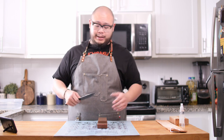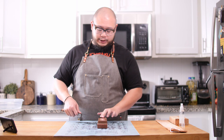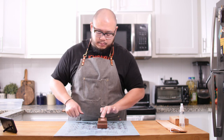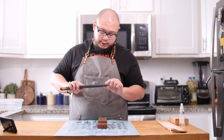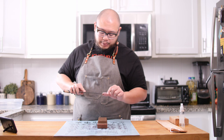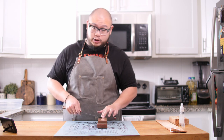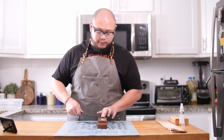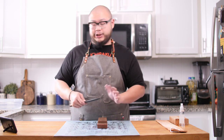The Sharpie line is your saving grace — it shows you where you've actually removed material. Once you've removed enough material and developed a burr, flip it over and do the same process until you develop a burr on the other side. I like to start at the tip and count my strokes. I check for the Sharpie line as I go. On this stone I've used for a long time, about seven to ten passes per section is a good start. Apply pressure as you push away.